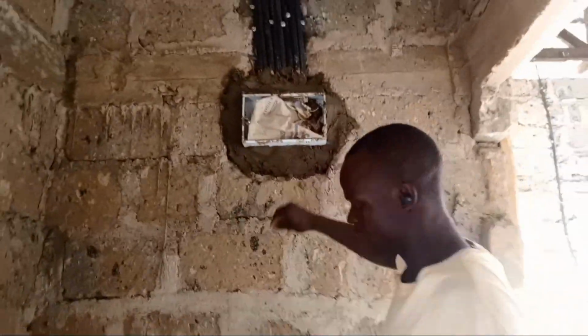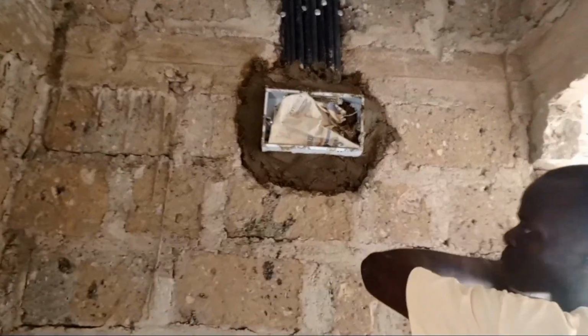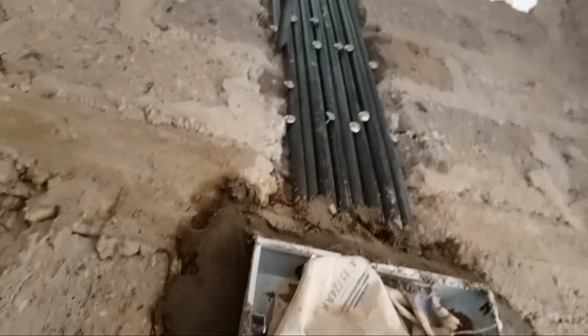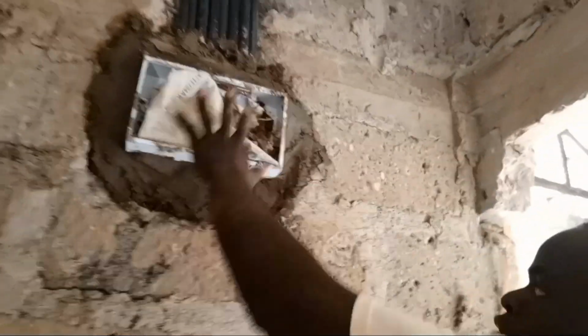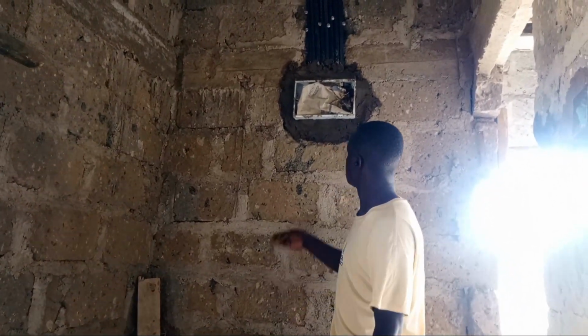So we had forgotten this CCU, a consumer control unit. This is the main power point intake for this room. All power like lighting, switches, sockets, cooker, AC, they will tap here, and from here it comes from a meter box. So here we'll provide the MCB according to the rating: for light, it may be 6 or 10, for sockets 15 to 20, and for cooker and AC we always provide about 32 amperes. So this will be the work.